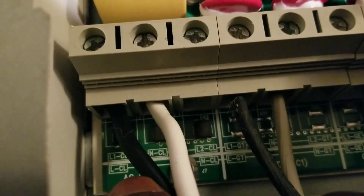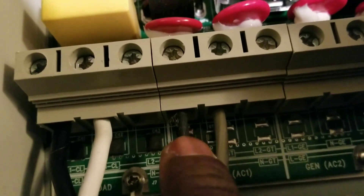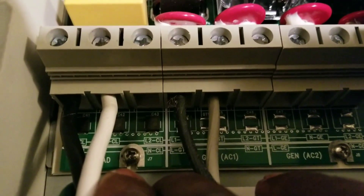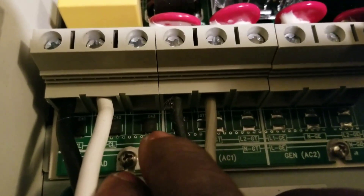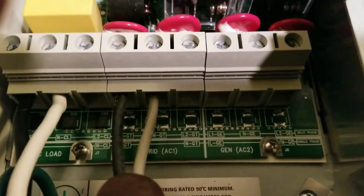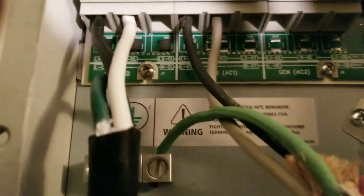Let me take this wire out of the way. The white one is a neutral, and L1 has leg one in, and leg two is right here. If I want to take out 240 volts and go to my main panel, I have to put another wire here that gives me the 240. Right here is the AC part — you can see the grounds are all here on the lugs.